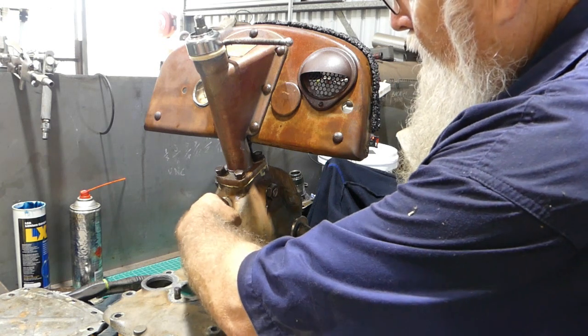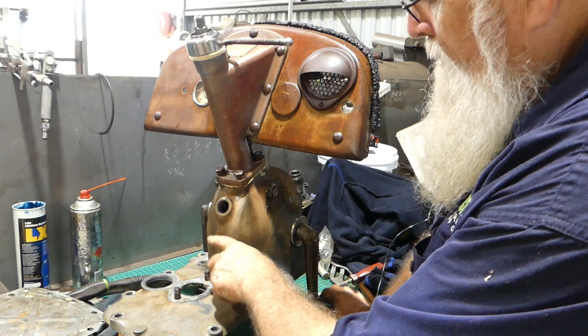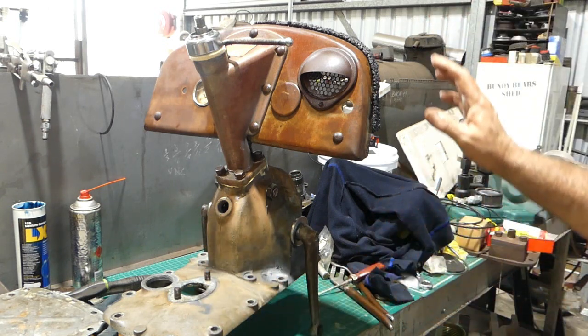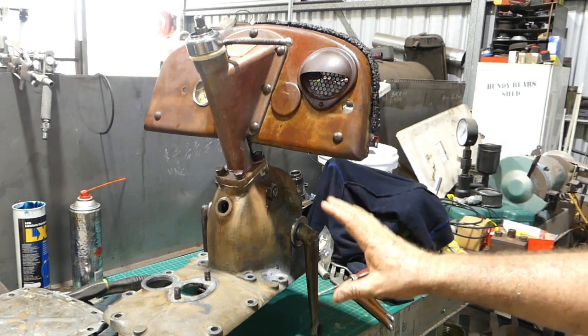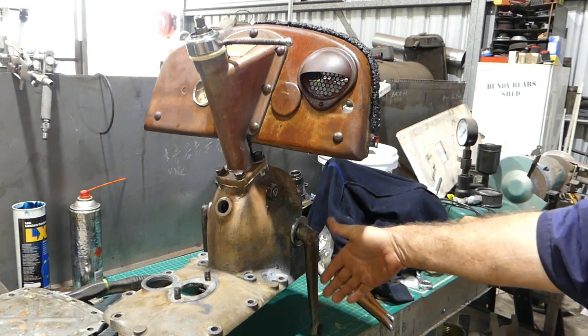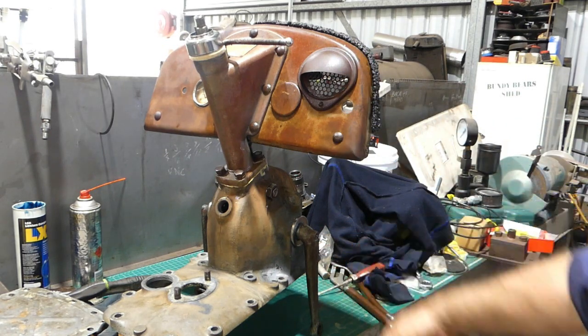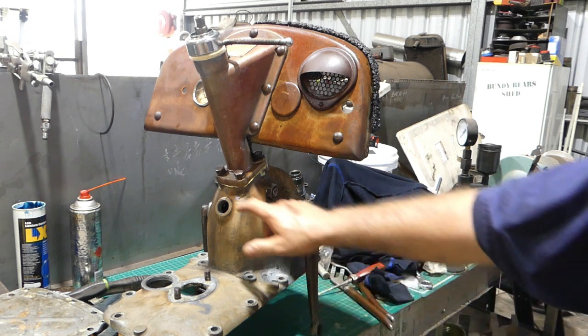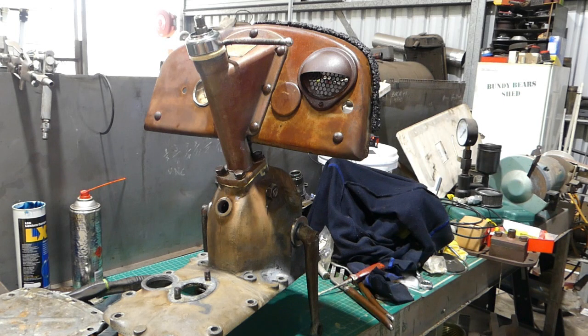When the bottom's on you fill the oil up to the bottom here — I'll have a look and see if there's a proper measurement. But next time you see this box it'll be on the tractor bolted back on ready to go. And we'll talk about how we're going to set the front axle up, how we're going to do the toe-in, and checking the oil and all that. So that's it — that's the long-awaited steering box video.